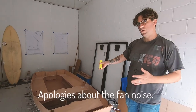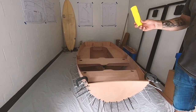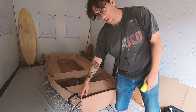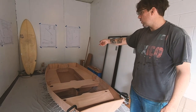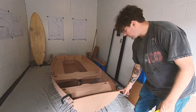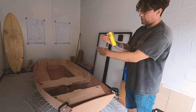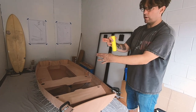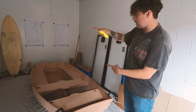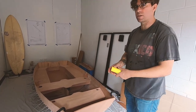Today we are going to make sure that our dinghy is level and in alignment. We have this bright yellow twine which we will run from this corner to the aft opposite corner, then around the back to the other corner and back up to this corner. The idea is that if we can make an X on both sides where the lines just touch at the center line of the boat, and then loop it in the opposite direction and it touches on both sides, then we're in perfect alignment.